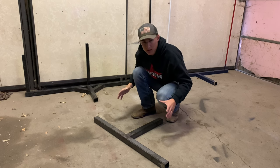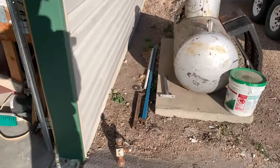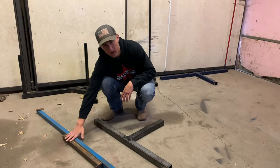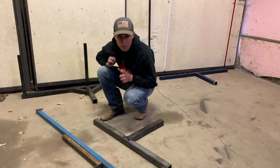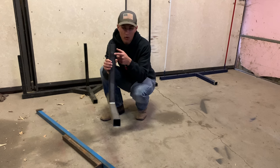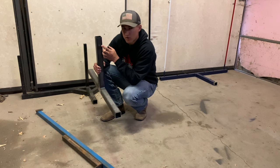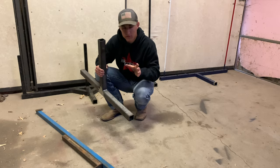The next part of this project is putting on these pipes. Now, we can't put this in a truck if it doesn't have a hole for a hitch pin — it would just fall out the back. So what you're going to want to do is measure in from the end of the bottom of the tee about two and a half-ish inches. Play with it depending on your hitch receiver and how deep it is.